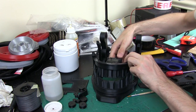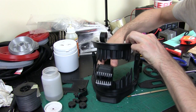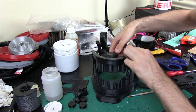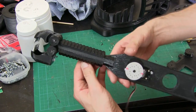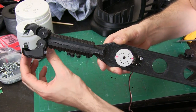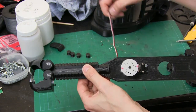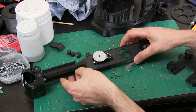If we can imagine that coming out of the jaws it opens — I think that's looking pretty good and I need to paint these teeth silver as well. I've got this assembled and I've got a little servo in here which is a normal radio control servo that will turn. I need to make a custom rod to have that push the back of the jaw so that it opens and closes when the servo turns, and we can control that with the servo controller which we'll look at in a moment.